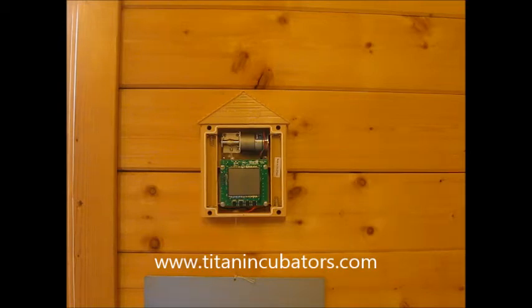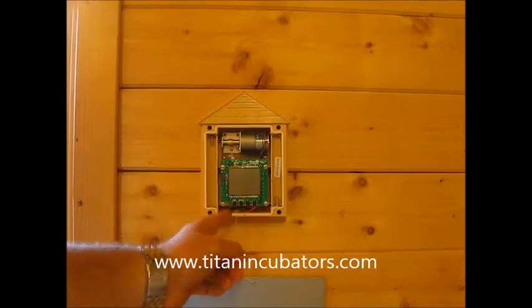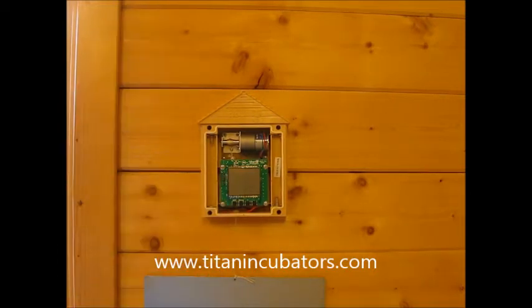It's vital you attach the door at this stage, as a common mistake people make is they try and operate the door without any weight on it. If you try and operate the door without any weight on it, it will not work. It has to have weight on it to sense where the door is and what position it is. But I always set the door opener up in position. The string must be straight down, not at an angle, so as it lifts the door up and down, it's very simple, it's very in line, and there's no extra pressure from being at the wrong angle. So the next job now is to insert the batteries.